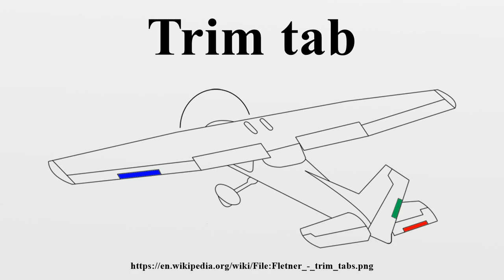In the case of an aircraft where deployment of high-lift devices would significantly alter the longitudinal trim, a supplementary trim tab is arranged to simultaneously deploy with the flaps so that pitch attitude is not markedly changed. The use of trim tabs significantly reduces pilots' workload during continuous maneuvers, allowing them to focus their attention on other tasks such as traffic avoidance or communication with air traffic control.